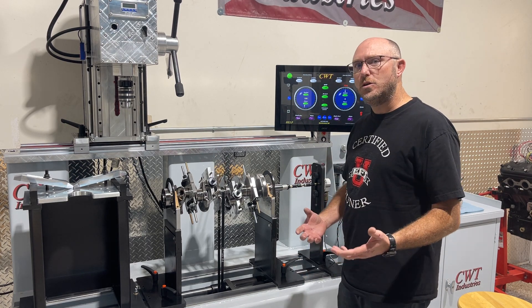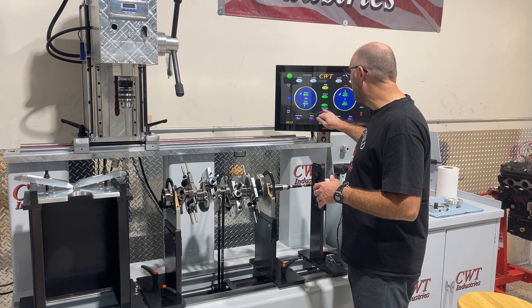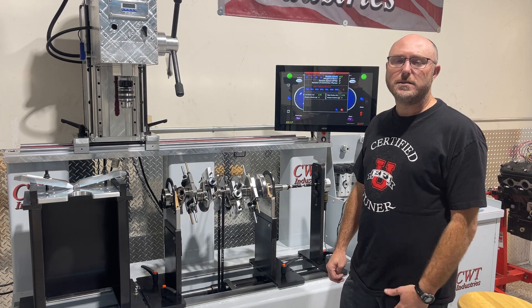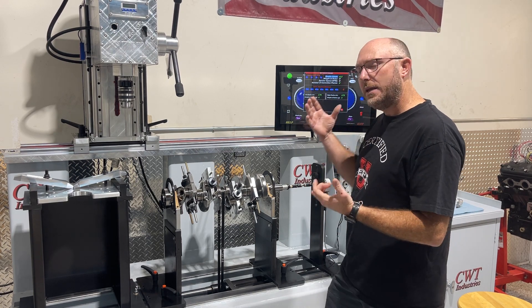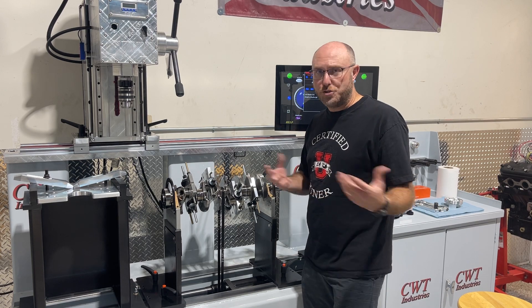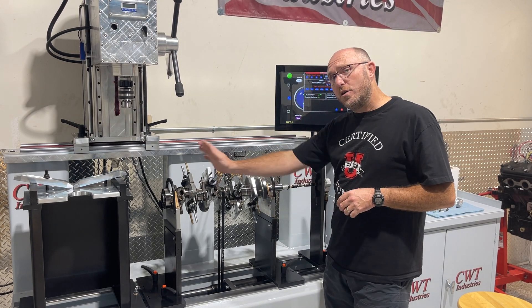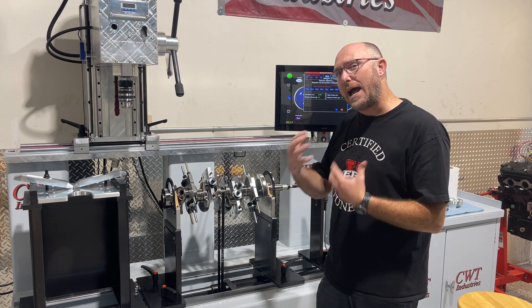And primarily that all has to do with numbers. Now that I can come up with a bob weight, I can put it on the crankshaft and spin the thing. One of the things I liked immediately was that when we go in here to set things up in the balancer, I can go over here and create a standard for the tolerance — instead of just using 'as long as it's better than 10 grams' or 'two ounce-inches' or whatever these industry standards were. It made sense to me when we talked about how depending on the RPM you want to run and the length of your stroke and the weight of your components, the value of tolerance that you should allow should be changing.